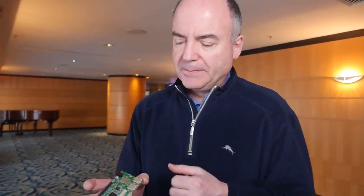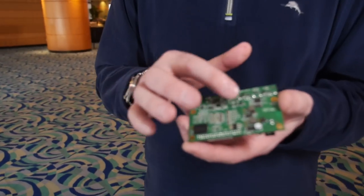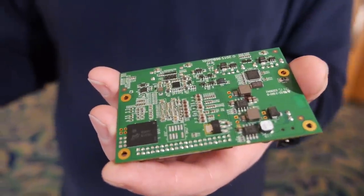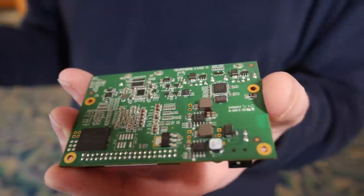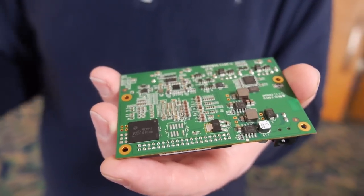This SOC is used in a top-range Huawei mobile phone today — the Kirin 620, 8-core A53 used in one of Huawei's latest mobile phones. This is a mobile phone optimized SOC, but there could be some SOCs more optimized for things like set-top boxes that could use SATA. Most mobile SOCs don't have a big disk drive, but you do have flash memory, and you can put multiple flash memory chips onto this footprint. If you actually want an external disk drive, then most likely you're going to be using the enterprise version.